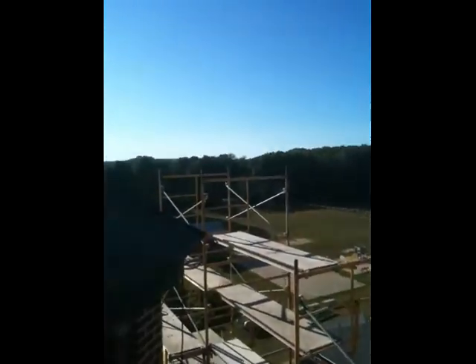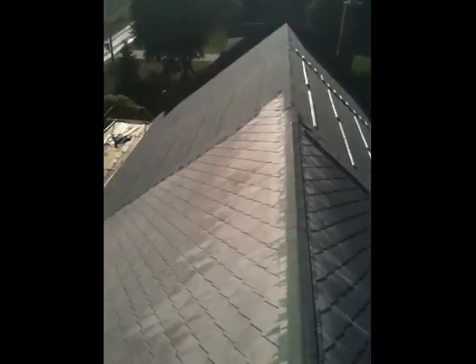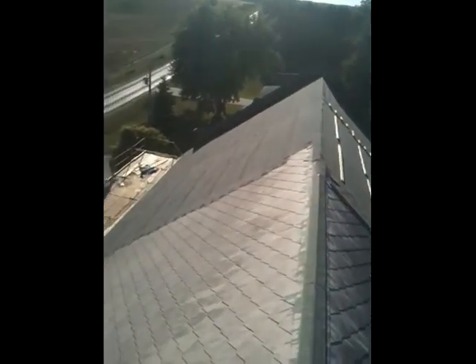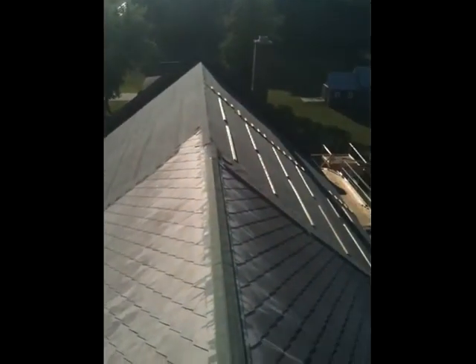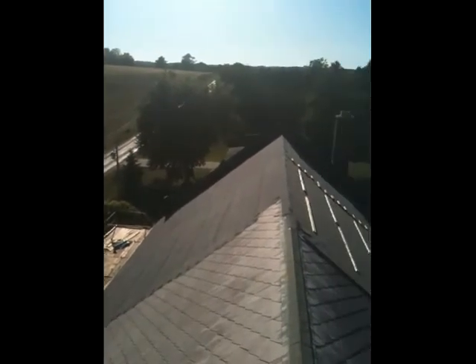Here's a panorama shot of the whole countryside. In the foreground, the diamond-shaped shingles are the second-generation asbestos shingles. In the distance, you can see they've been removed. Beneath those were another layer of asphalt shingles. Now on the roof, the black material is ice and water shield, which provides a watertight cover while we get the slate going down. At this point, the slate arrives and we'll start snapping chalk lines on that black material and nail the slate up.